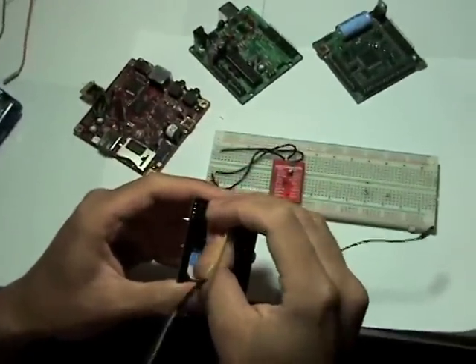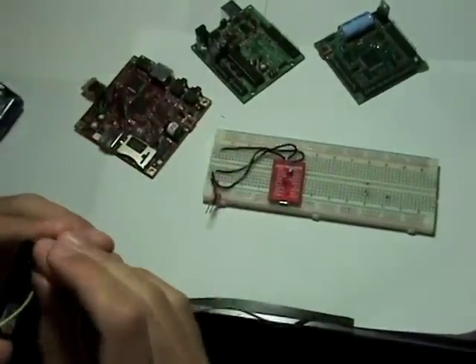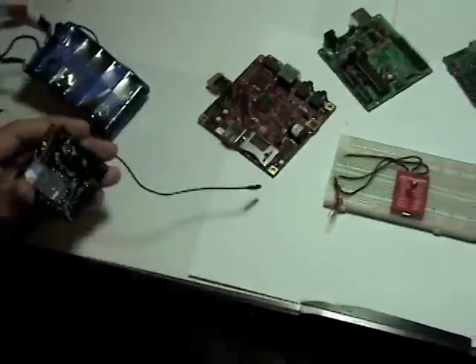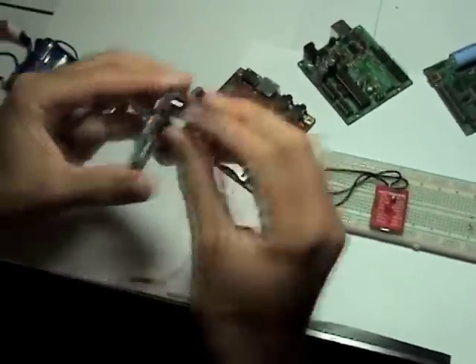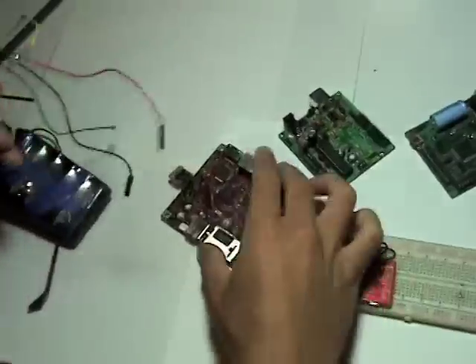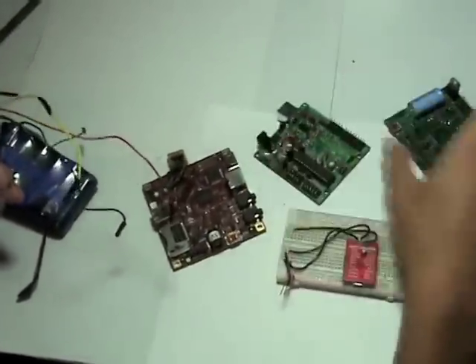As you can see right now, I'm just connecting the TX and RX lines, and then I'm going to connect the power and ground line. Now I can just interface it to any series of devices — either to the BeagleBoard, RoboDuino, or the Axon.